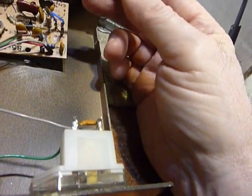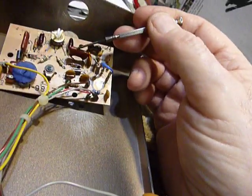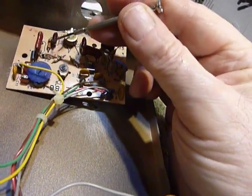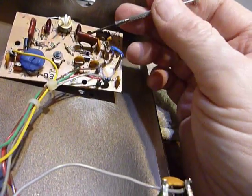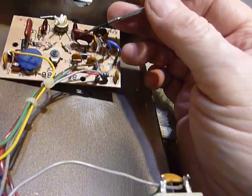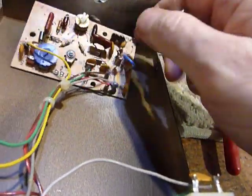The capacitors have been changed as well. The 1000 picofarad capacitors — the VHF model used 100 picofarad — so I changed these to 1000 picofarad. They're a little bigger, but I bent the leads in a little closer and they fit in there just fine.